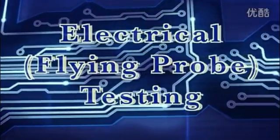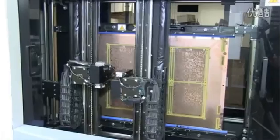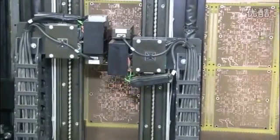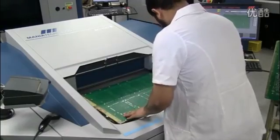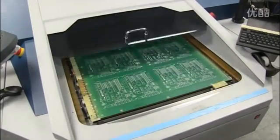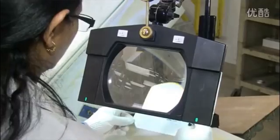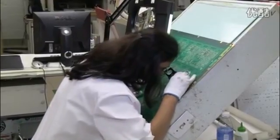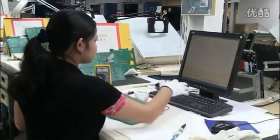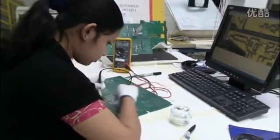Before we ship, we need to electrically test your boards to make sure that there are no shorts or opens. We perform this process with the aid of our six flying probes and seven grid testers. We're so confident in our systems that we offer a blanket guarantee on our boards for any defects that should have been caught in this process — an industry-leading guarantee that to date we have found no one willing to offer to their customers. To make sure there are no defective products, all boards go through 100% 2.5x zoom inspection. Each panel is scrutinized with the toughest quality inspection procedures before it is released to the next process. Our inspectors are rigorously trained, and must pass a rigorous training and testing period prior to becoming a certified inspector.